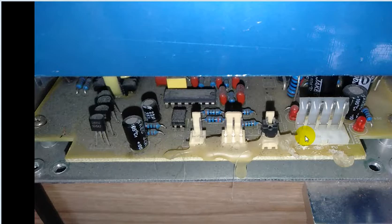When I take a look at the power supply, the condition is like this — inside it has a lot of dust, and it is totally down. It cannot turn on the power. I think the dust is the cause of the problem.